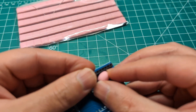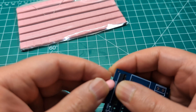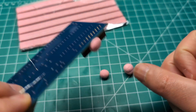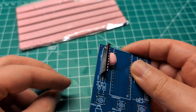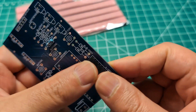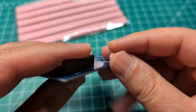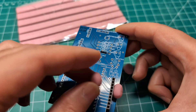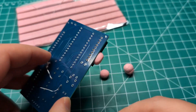So I can put the header here and place the putty over the ends — you don't have to press it really hard, just tab it in. Put one on each end, and as you can see, this is holding the header in place. My header is not going anywhere, and I can solder on this end. Removing the putty afterwards doesn't really leave any residue and the PCB is fine.